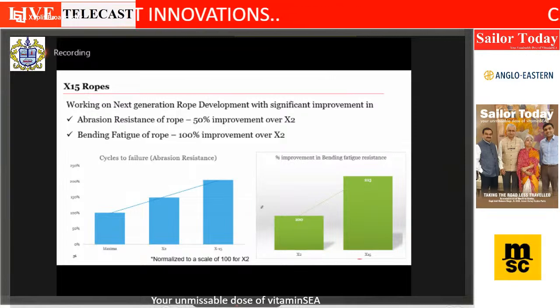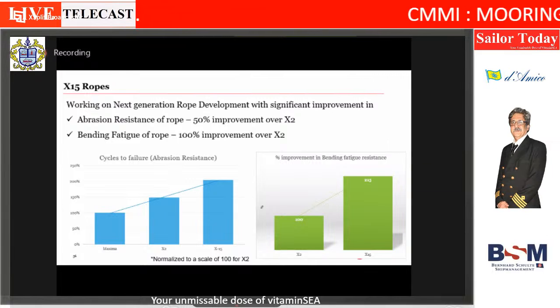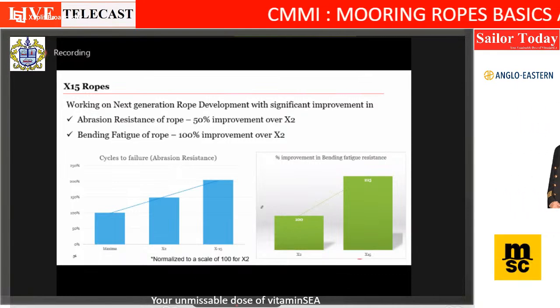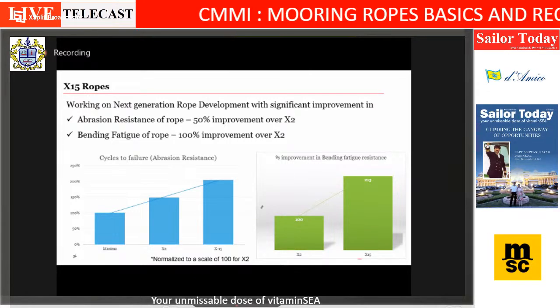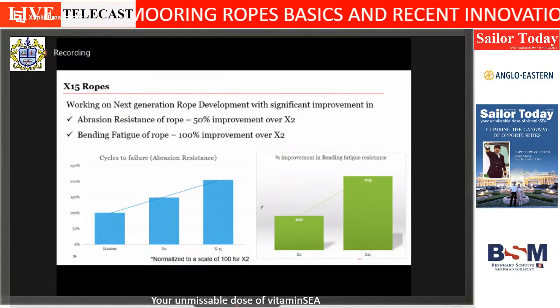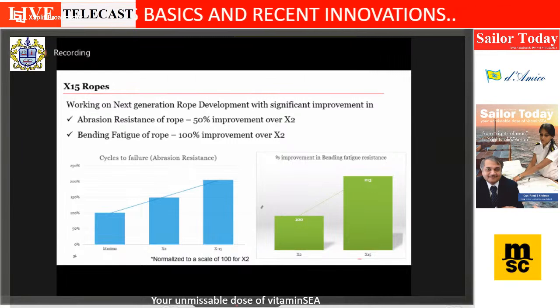There was one of the ports in Rio Grande, in Brazil, where the port is at the end of the river, where the ship is in constant motion. And she's in constant motion under different loads. While the draft increases, your resistance to the water flow is going to increase, and the chaffing is going to take place much earlier than what we can anticipate.